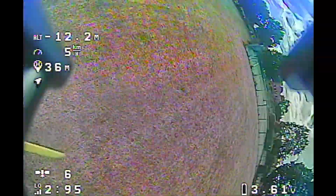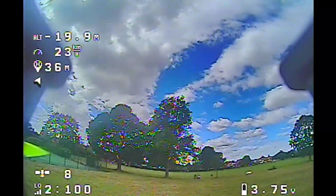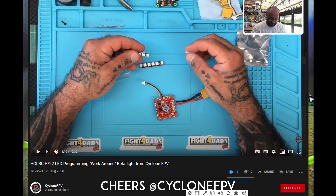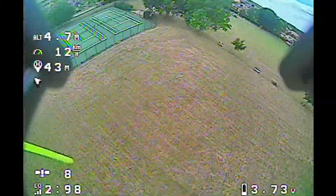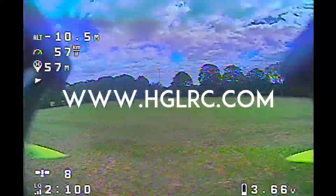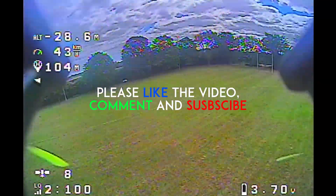One thing with the F722 Mini is that the LED sockets only work with a built-in LED controller — you can't control them via Betaflight — and this wasn't well documented. In future I'd like to see more documentation about the LEDs and how to get them working with Betaflight, as it took watching a YouTube video to figure it out. Overall they've both been very good and I'm very happy to own them. Thanks for watching!